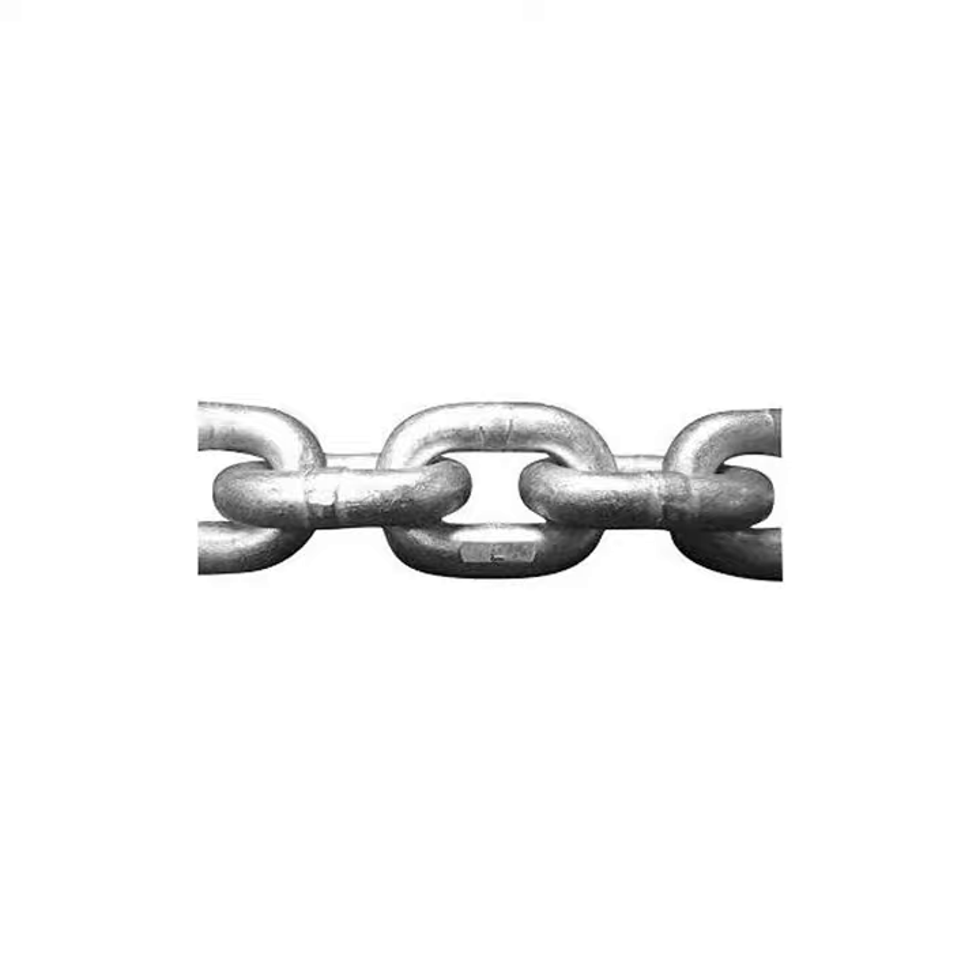The anchor chain is 20 to 30 years old. There's not enough of it, and I've done the sums — I don't think it's worth acid washing it and then re-galvanising it. It's not economical. And if I add more chain, that means adding a link, and there's always a failure point at the link. What I'd like is a full continuous length of good quality chain that's going to last me 20 to 30 years. That's the challenge.